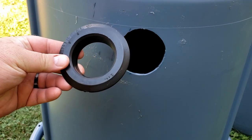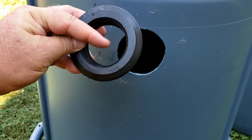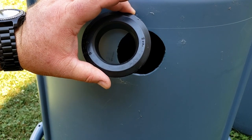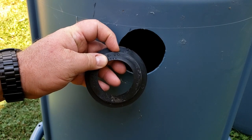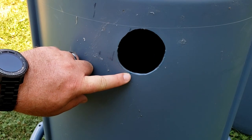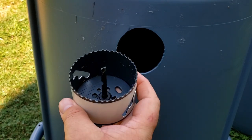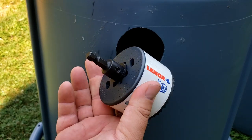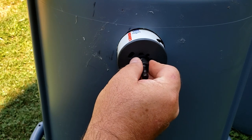What we're using to join these together is a two-inch uniseal. When I say two-inch, that refers to the inside diameter. So you're going to use a two-inch uniseal with two-inch PVC pipe — but that's not the outside edge you trace. There's a little lip on the inside of the uniseal; I used a Sharpie to trace around it in a circle to get the template for where to cut. I should have used a proper hole saw from the start — looking at the old cut I made by hand, there's a lot of play, and that's exactly why it didn't work.